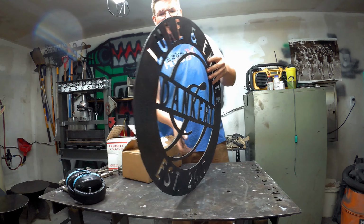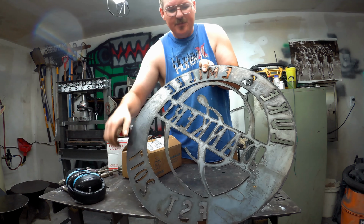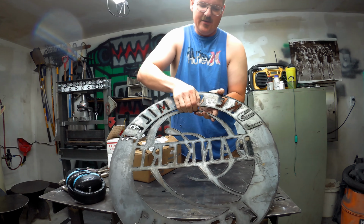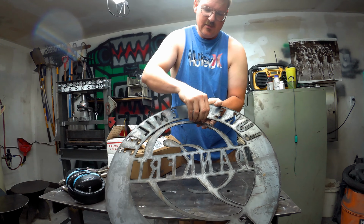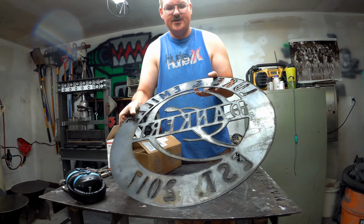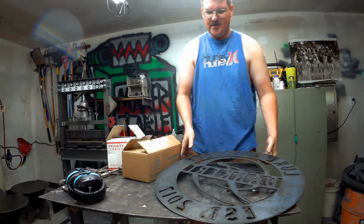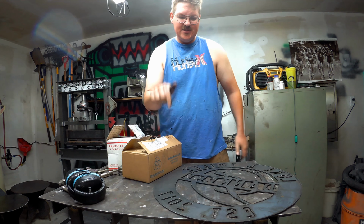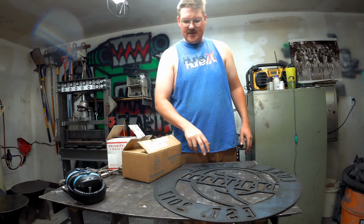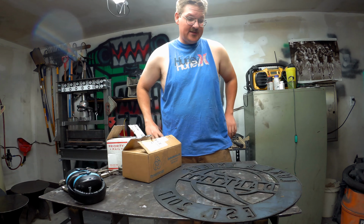You know, this is fresh out of the machine. See a lot of slag back there still. Some of it's pretty big slag that just comes off of the finger here. Not too tough to get off, but this is really no torch height control running at all. This is just the touch off sequence, finding the sheet, and then cutting as best it can. So that's something we gotta work out, because I hear you can get the slag down, almost eliminated on these, so I'd really like to get there.